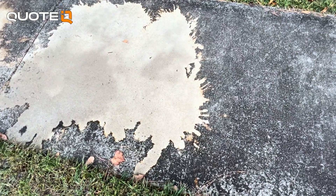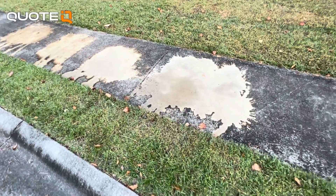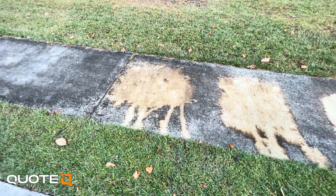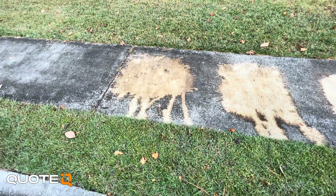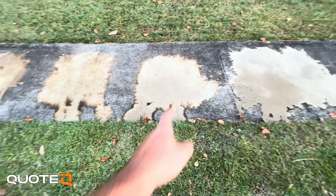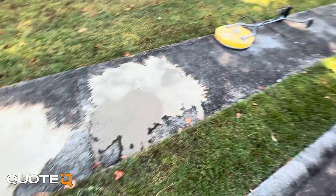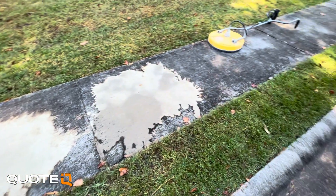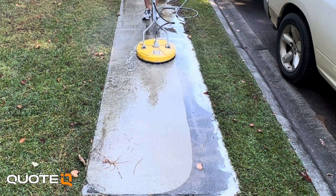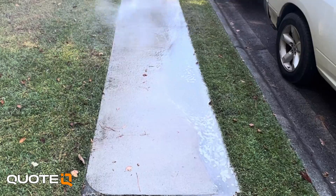In theory, you could lay down 10% and get nearly the same results as a surface cleaner, but you risk damaging sod or whatever else is nearby. You can definitely see the difference in your percentages and the impact on various surfaces. For vinyl or surfaces that don't require a ton, you can get away with a regular house wash mix for pre and post treatments. If you've got a driveway with some minimal buildup, hit it with 5% and you're probably not going to have to surface clean. Understanding how to mix is essential — you want it strong enough to do the job, but not so strong it causes damage. Download Quote IQ for the free mix calculator, and check out How to Wash if you want to shortcut the learning curve and hit the ground running.